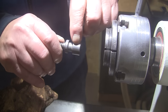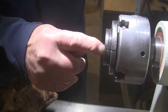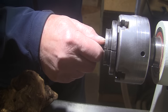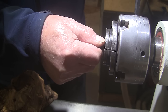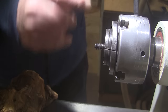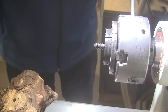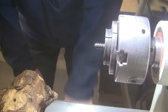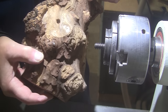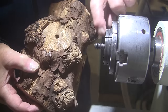See the flats on here? Those go in a particular place. Right now it's loose — I'm slowly tightening it, watch this gap. Now that it's tight I'm going to back it off ever so slightly and rotate that screw until I find those flats, and then I'm going to pull out on it. That's important — pull out on it and then tighten it up. Now it's going to hold really well if your piece of wood is solid. You also need a flat spot — not almost flat, not a little piece of bark in the way. Flat. That goes against the front of the chuck jaws.